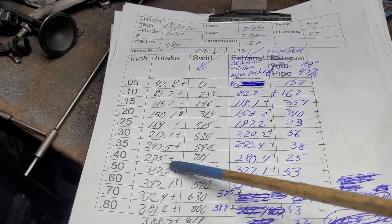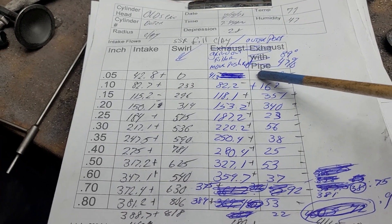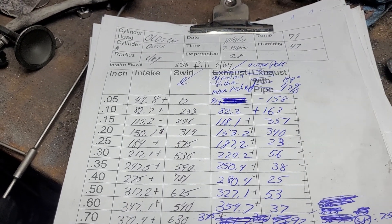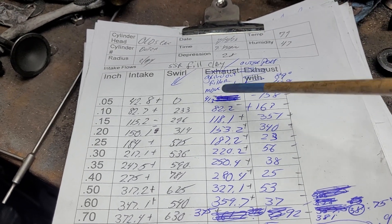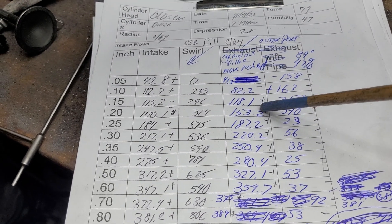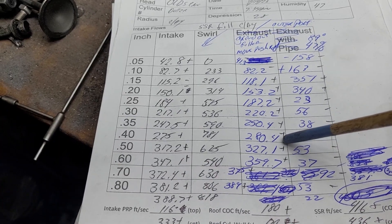This was the filled port — the owner was pretty happy with it the way it was. This is a bigger port now, so as long as everybody understands that — we added 21 cc's and some grinding, so let's just say we added 25 cc's. He knows what the port was originally; he can put that into his program and then he can use these numbers.